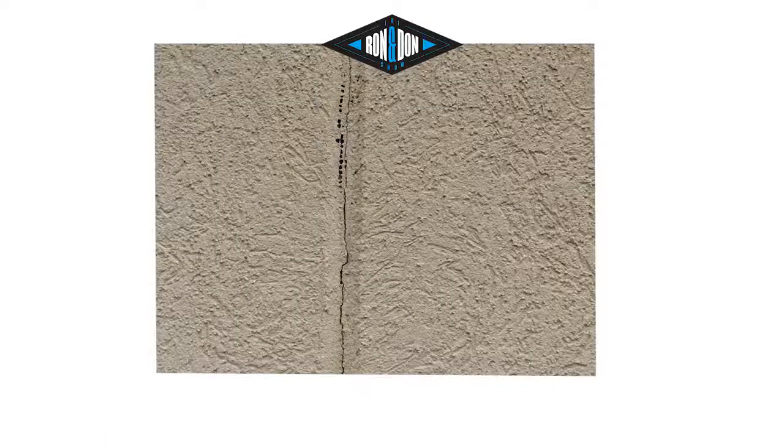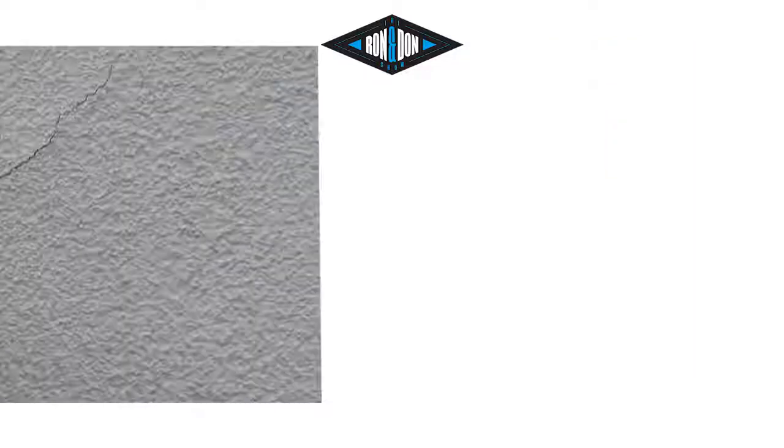So again, when you go to take them out, a lot of times what happens is you damage the Dryvit laminate or the surface or the face of the system because you're trying to remove it to get your new sealants in. Now, when we're looking at a building, we've got cracks through the building. What's causing that? It can be caused by a lot of different things.